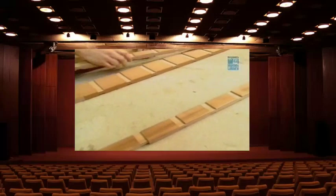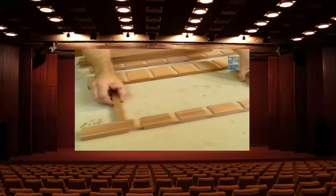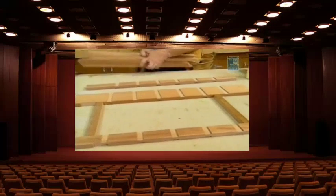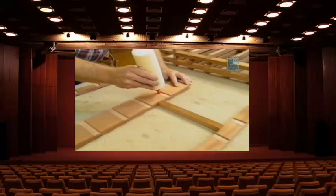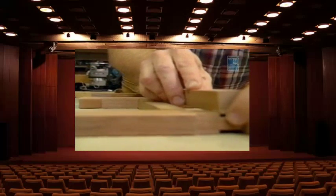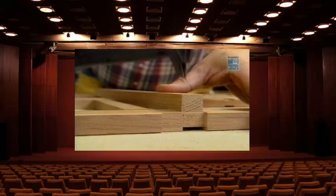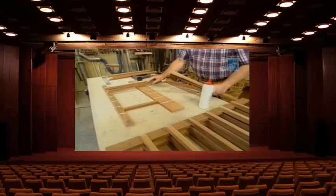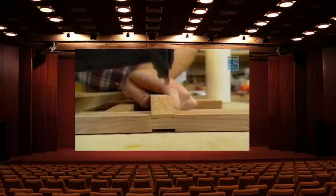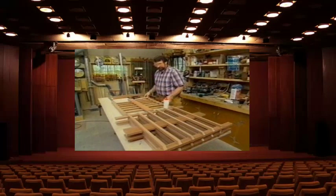Let me show you how one of these goes together. The bottoms have the notches and I cut some scrap pieces of wood for the distance between the outer standard and the center one, so I don't have to make measurements all the time. I'll put a little dab of glue at each dado, set the bottom cleat in, and secure these pieces with a one-and-a-quarter inch brad at each location. Then the beveled cleats go in, and I'll flip it over and repeat the process on the other side.